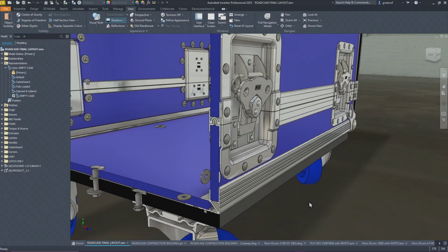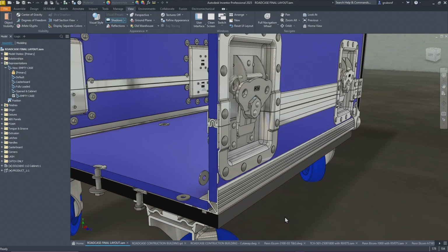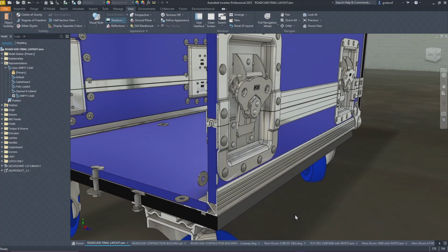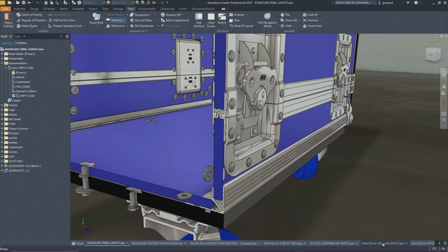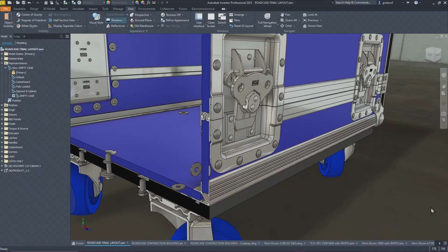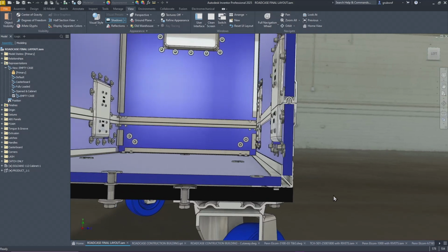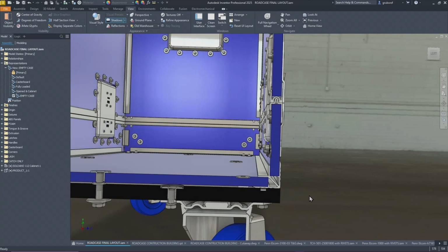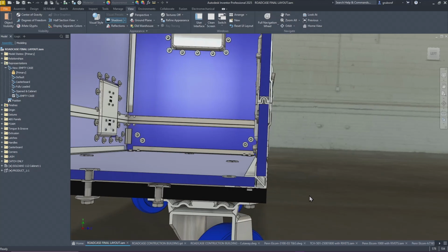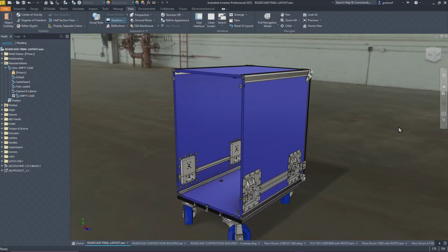A lot of people, there's 2 reasons for this. They wanted the case to breathe because it is metal, so it's out in the sun. It'll shift or twist. It loosens up in some ways if it's too tight. So they've used this, easier to assemble. Plus, if you do have rivets along here, a lot of flight cases that do tours just slam up against the wall, other cases, whatnot, and the rivet heads will get ripped off. And since it's only an L extrusion, the case will start to fall apart. You'll have to put more rivets in. It's a real pain. So it's nice to have this. It's a little bit more expensive, but it just works.